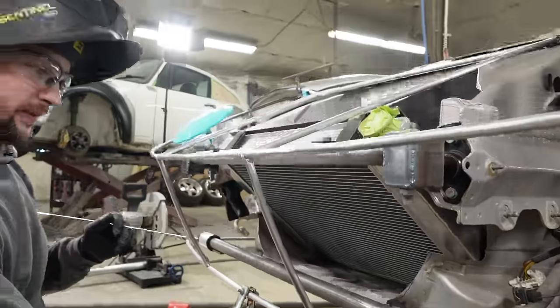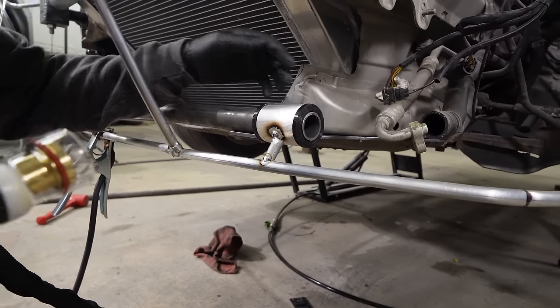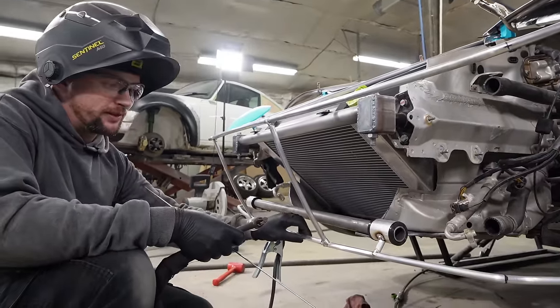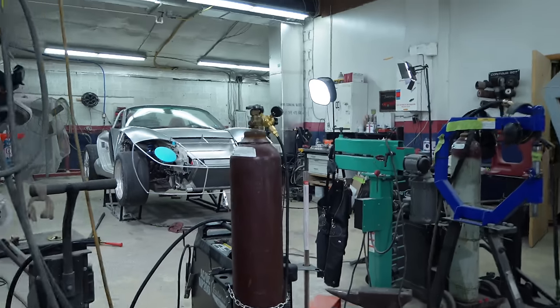That big tubing is really taking up the heat. Yeah, I also dipped my tungsten, which didn't help. Also, I probably ruined our bushings. Yeah, they're melting currently. We knew we were gonna print new ones, right? Yeah, or we're gonna melt these into place and then they're gonna work great. Turns out that our bushings are the same thickness as this filler rod. So we can replace our melted bushings with that.